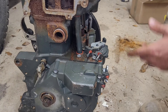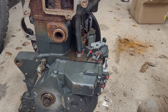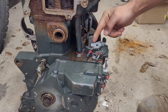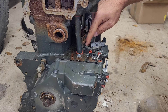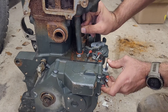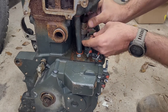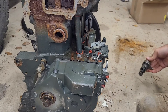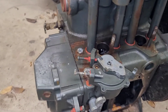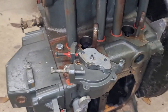You also need to do this to get the injectors out. Say this is how it's sitting and you're getting a little bit of movement but it's stuck — the reason why it's stuck is that little tab is all the way over and it can't come up because it has that little hole. So same thing: you're trying to take it out, you bring it over, and you'll actually feel it pop up and then it'll just slide out. I really hope this is making sense. A lot of people have shared pictures about this process, and even looking at drawings it's very hard to understand. I was hoping this would be helpful to people who get these generators and are trying to troubleshoot and fix them.